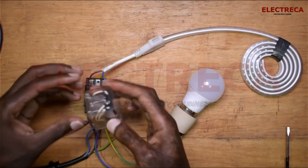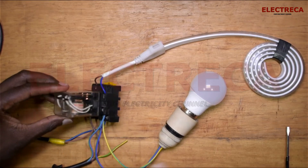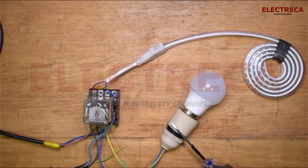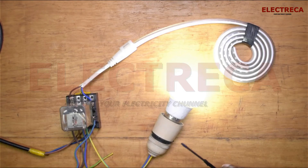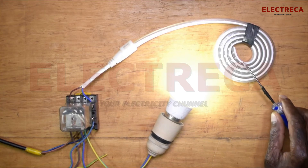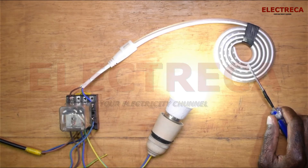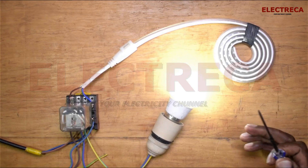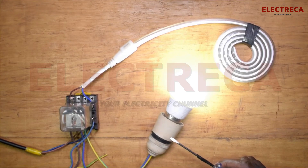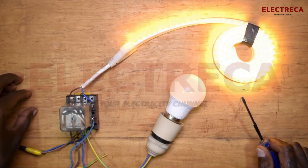So what we do is insert our relay. Now the relay works well. We are turning on our light here. Our power — our LED supply — is on. Assuming that this bulb is in the corridor, together with this LED or emergency light. In case this power goes and you're waiting for a generator, now the corridor is dark. The moment your supply goes, the LED will instantly come on because its power has been pending right there. It will come on instantly.